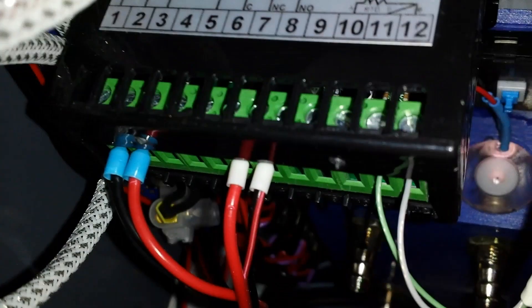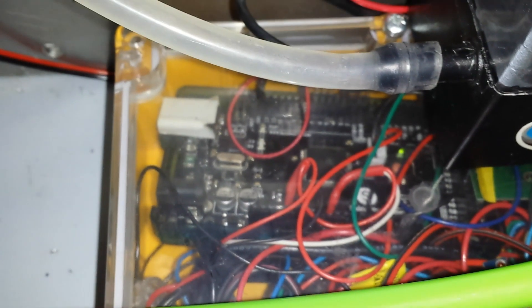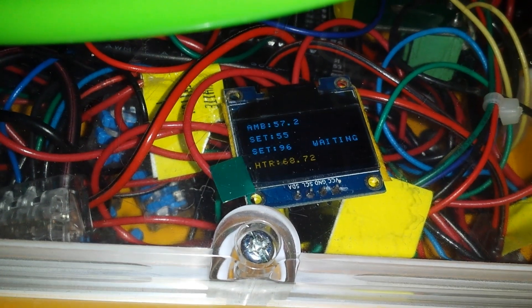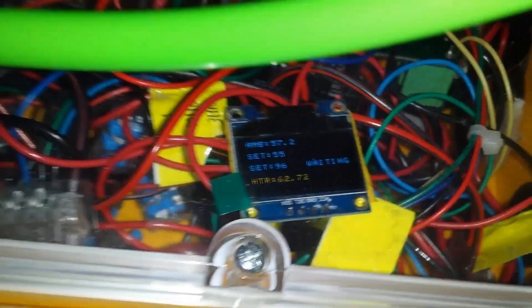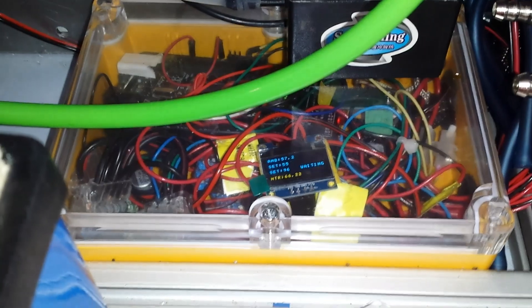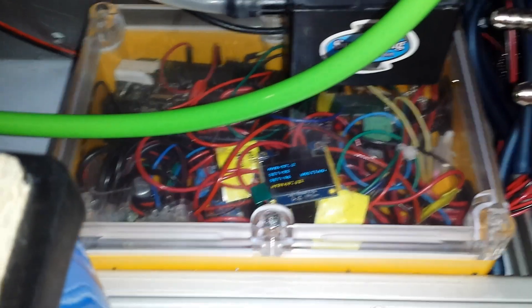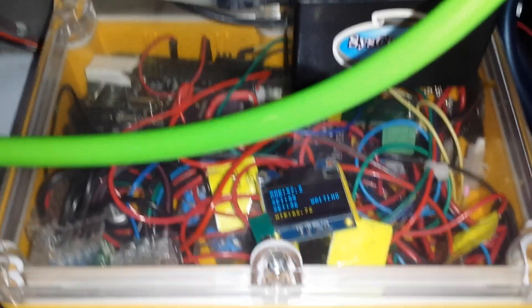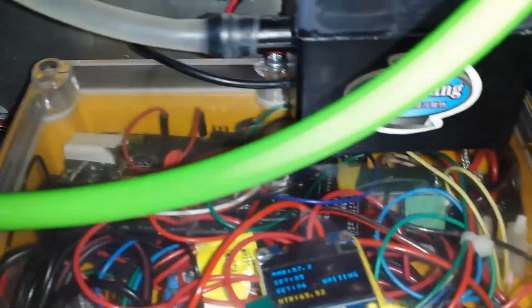What I'm actually doing is not using the solid state relay output — I'm using the alarm contact in the normally closed format. I'm still using the Arduino Mega and a little LCD display, all shoved in that box in a bit of a mess. So what I'm doing is using the temperature controller to protect the heat mat, while the Arduino handles the broader control.